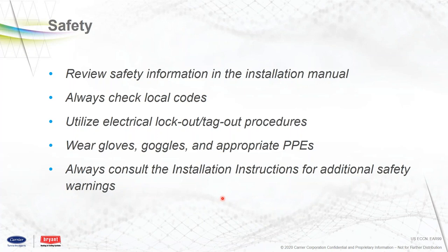Moving on to the rest of the installation with the outdoor unit. Piping and the evaporator coils — there's no change there. You've got the liquid line and the suction line. The reason I point that out is we're going to see a different component on the five-ton unit called a subcooler — a brazed plate heat exchanger subcooler. It's all internal to the outdoor unit, so the installation as far as piping and connecting to the evaporator is the same as before. Nothing special with piping — just ACR piping, brazing using a nitrogen purge.